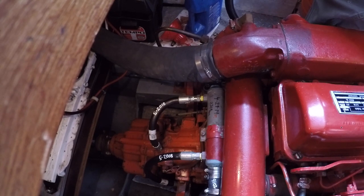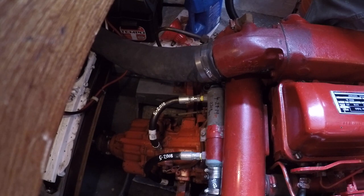I'm not sure what the full capacity is, but I hope I got the majority of the fluid out. I labeled the new hoses with the install date. The manual recommends changing the ATF every 200 hours, but with the newer fluids I'm not so sure that's still the case — the fluid I drained out was well over 200 hours and it looked and smelled about the same as the new stuff. The thing I learned today is that next time I want to be able to extract the fluid out of the dipstick hole and not have to get down on my knees in the bilge to drain from below.